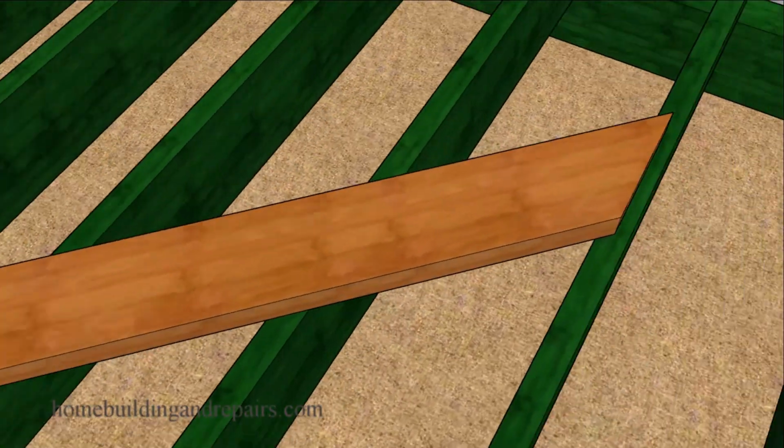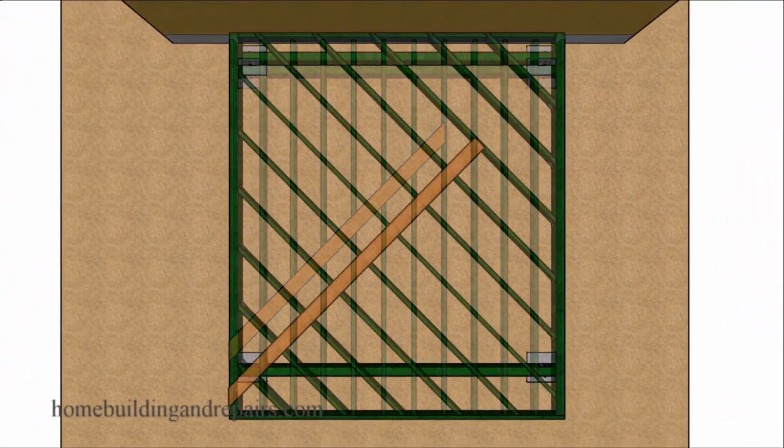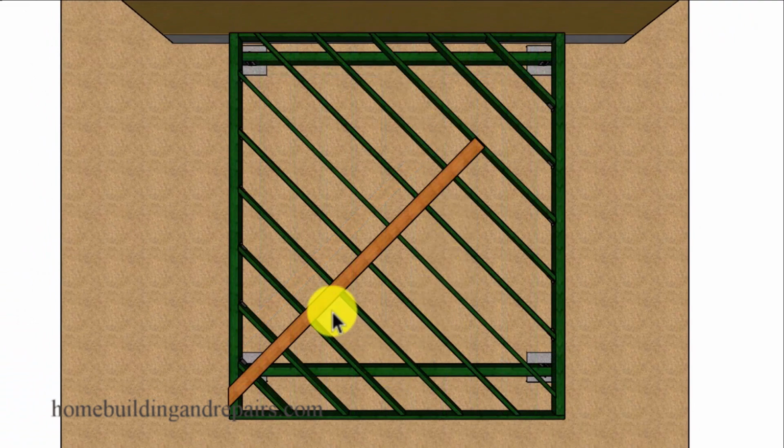However, there is another one. So let's go ahead and take a look at that one, where we are going to change the direction of the joist so that they will be perpendicular to our decking, or at a 90-degree angle. However, this design might require a larger board, a beam, or some double joist on each side, some blocking, and of course some additional joist hangers. And I'm not about to figure out which one is going to be cheaper.